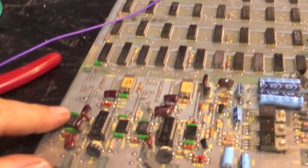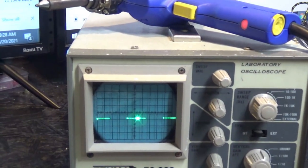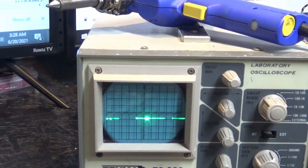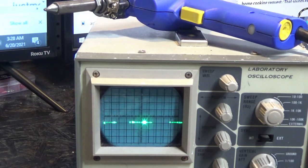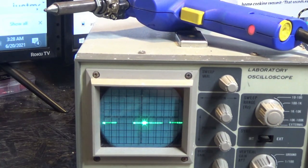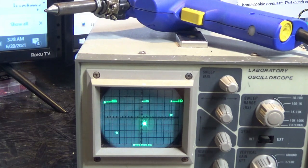Okay, so let's start back with this op amp. This pin, you can't see. Anyways, the one pin is the input, the other pin is the output. And so I'm going to show that on the scope, and let's see if anything changes. So I'm going to take this off of the Y out lug, and I'm going to touch 4, 5, 6. Pin 6 is from the DAC, of course, there's not enough current. But this, there we go.